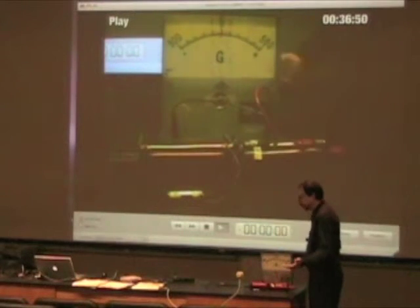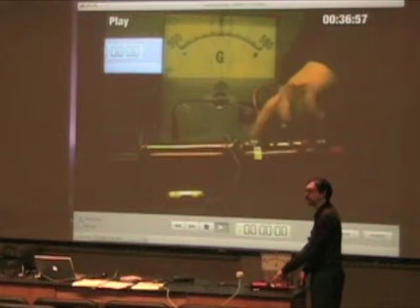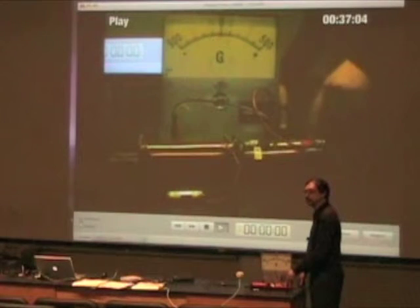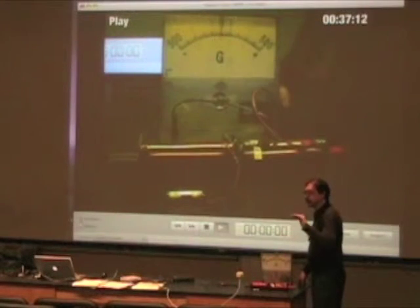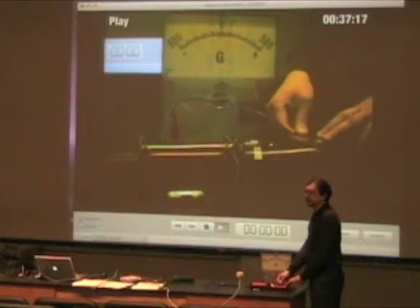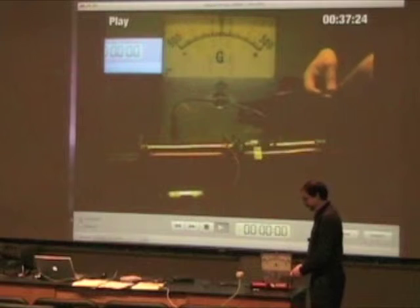Well, why would it? This coil, the secondary coil now, is not a battery. It doesn't have any potential difference across its terminals. In order to have a potential difference, the flux through this coil has to be different at different times. It has to change. But the flux provided by the primary coil is constant. So with constant flux, it doesn't matter if you have it connected or disconnected. It doesn't affect this galvanometer. It doesn't generate any current inside it.